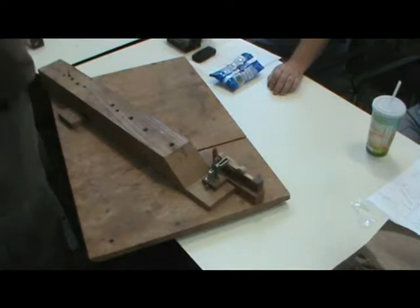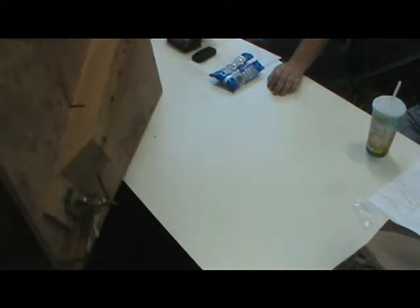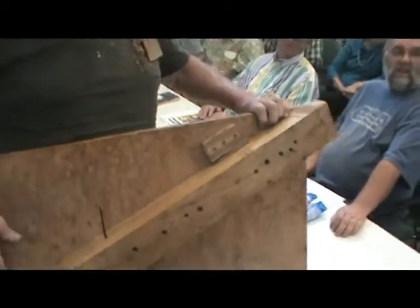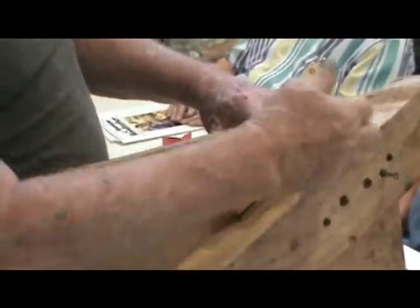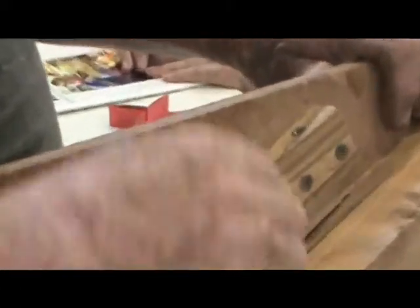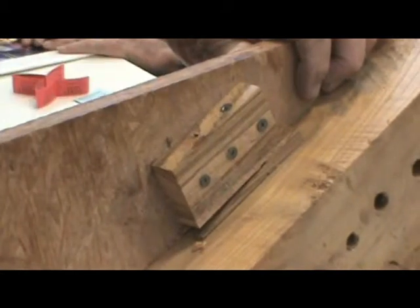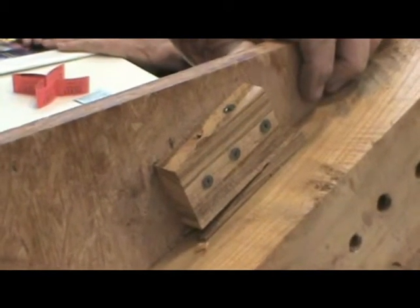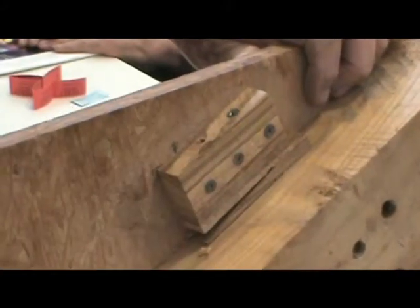What's the other thing that has to be the same? The angle. This is where I spend a lot of my time. There's a little block here and an arm on a pivot. There's a little wedge and a screw that holds this arm tight against the block. So what I do — I cut the ring and I look at it and see how well it fits. Depending on how well it fits, I move that little wedge back and forth just a little until it fits.